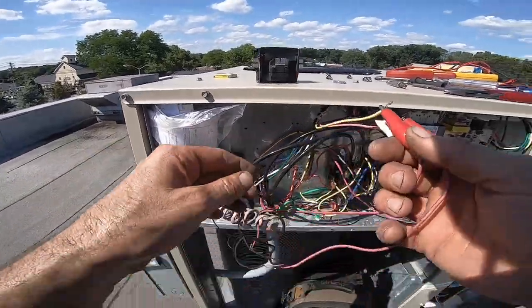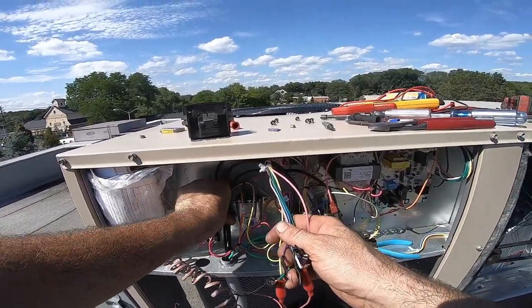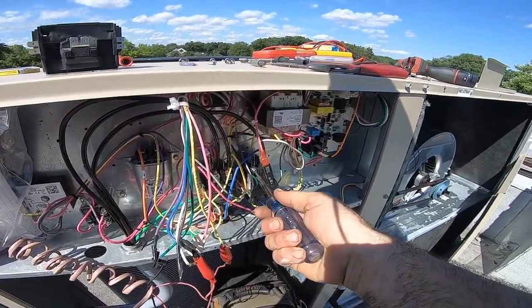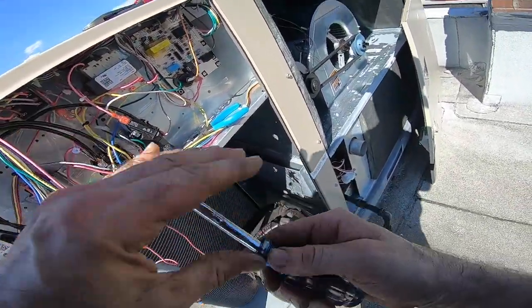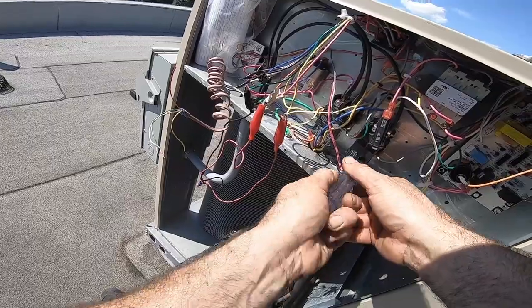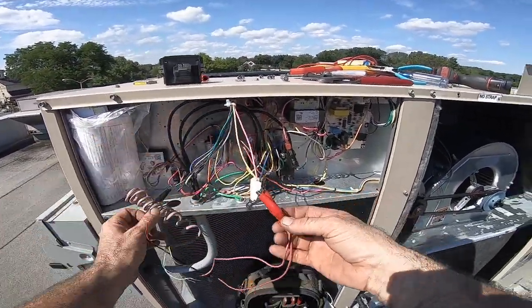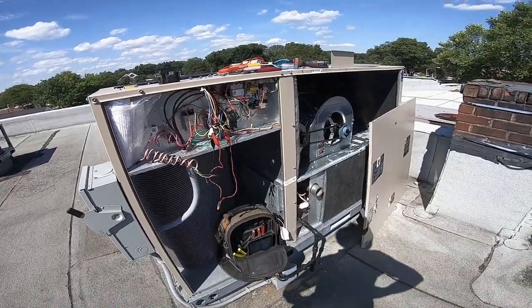Okay, so right now, what do we have here? All my low voltage, all the line voltage, put kind of like that. Go off. Make sure I didn't jump ahead of myself here. Tight. Tight. These are loose. So tighten them. From the factory, most likely. Alright, so right now we have low voltage tied R, Y, and G. Breaker reset. Blower's on.